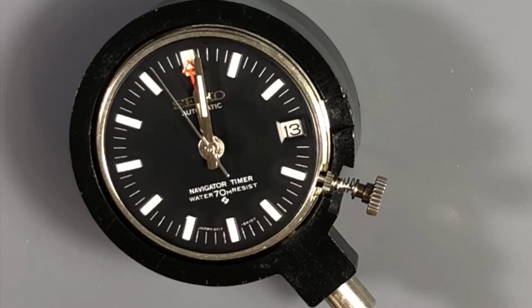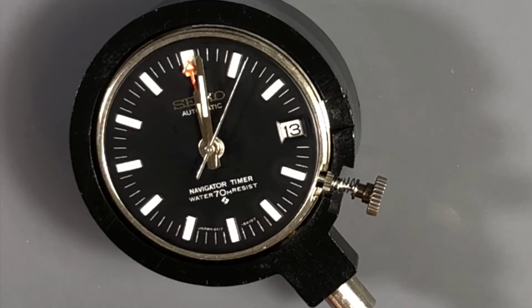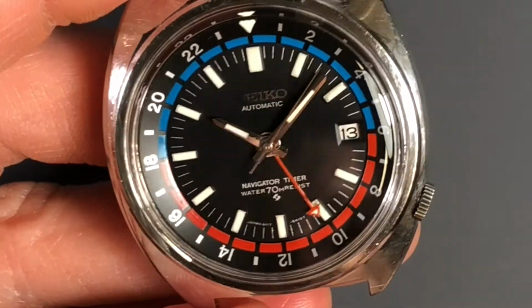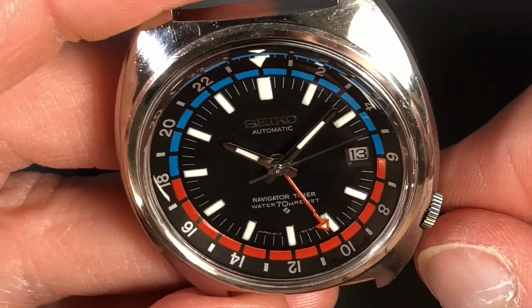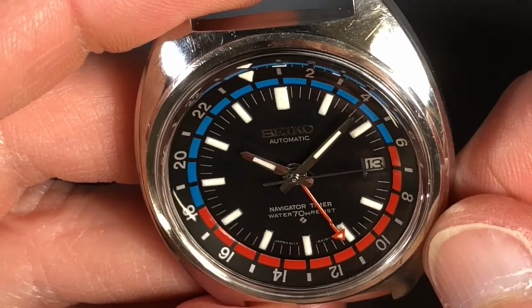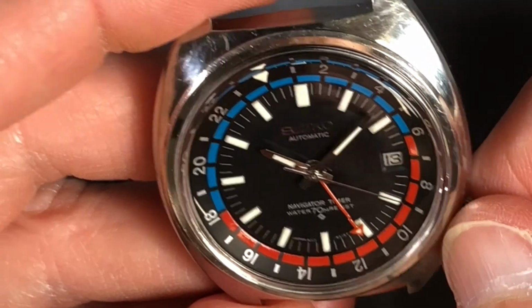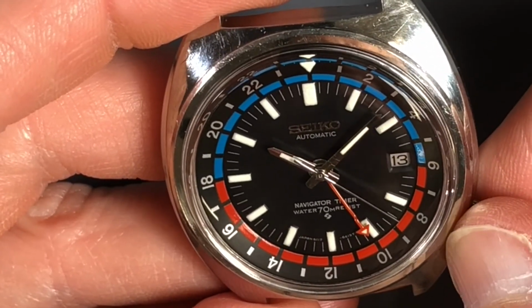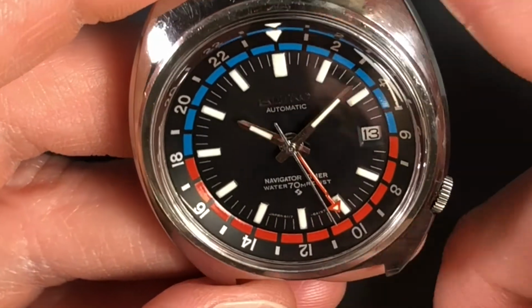And I'm going to go ahead and set the new crystal into the mid case, get the bezel back on, be sure to put the internal bezel in there as well, and we'll come back and take a look at the final product and see what you think. Well, everything back in the case and aligned correctly, and everything's operating very smoothly. Our internal bezel now has some resistance. When we turn it, it'll stay in place. We've got new gaskets on that crown, so we'll be able to make adjustments to it, and it'll stay where it's supposed to be and not just free spinning whenever you bump the crown.